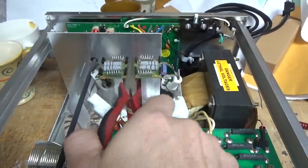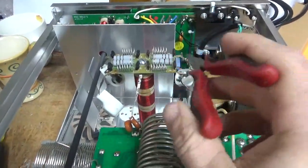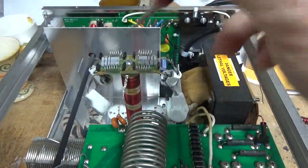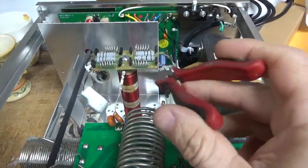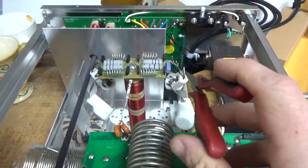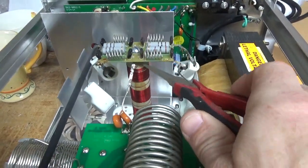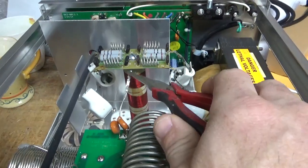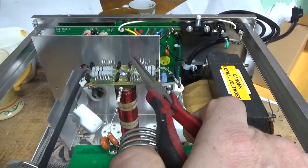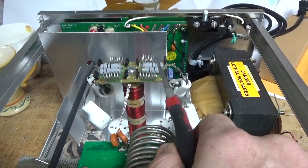So I'm going to say something — these boards are fine. I don't have problems with them. Maybe it's because I ground the grids and everything's correct when they leave, but I don't have parasitic problems or any of that stuff. So if you forget to put the split washer between the board and the top of the choke, then the strap can touch areas where it shouldn't be touching and you have issues. So again, no real reason to upgrade the board.